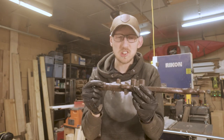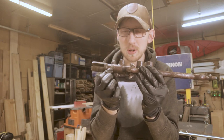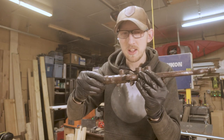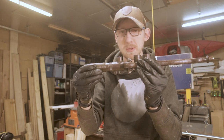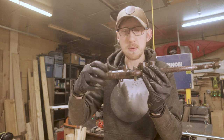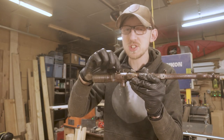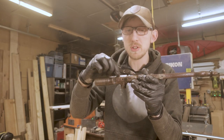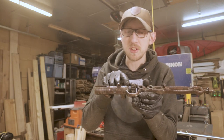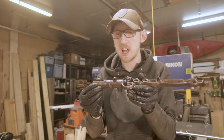But what I did find kind of interesting is that there's these two knurled knobs right here. And what these are meant for is to actually take up the slack in the gear here. Because if we tighten them all the way down, you can see that there's actually a pretty good amount of slop in there. But just by adjusting the tightness of these, that then takes out all the slop but still gives you free movement. The same thing with the screw that was in here that I was desperately trying to take out. This is just meant so that once you take that slop out, you tighten up this screw and it compresses the body down here so that these little thumb screws can't be moved in and out anymore. Then you theoretically should never have to worry about the slop coming back in there.